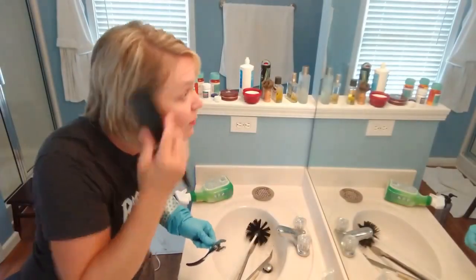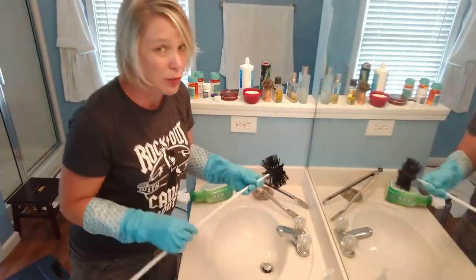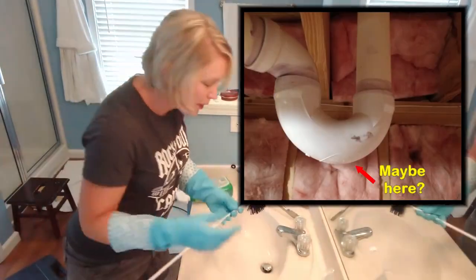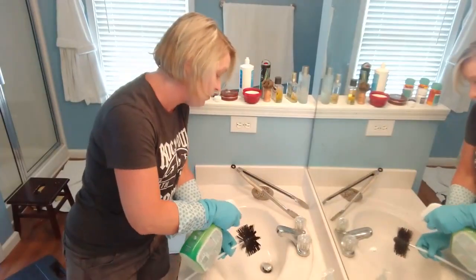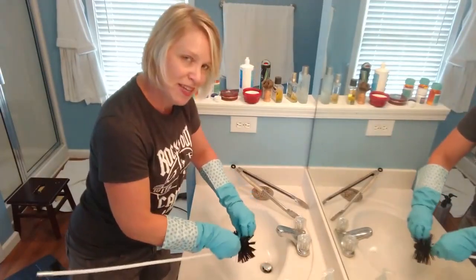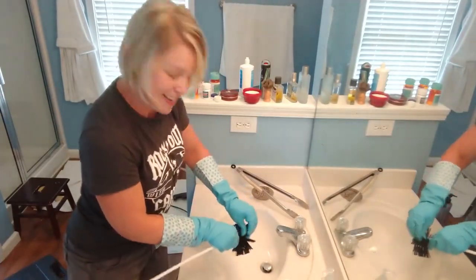I'm impressed after all of that. Now I think this thing worked fairly well. It is pliable, so it's meant to go around curves. I know it didn't go all the way through that trap, but I think it did get in there a little bit, and if it loosened some things up and got them rinsed out, that would be great. But I don't think that's where the main problem was anyway — I think it was at that very beginning part where everything was so clogged. And if that doesn't turn out to be the case, and all I did was just compact a bunch of stuff down in that trap, then I guess my next video will be about going to buy a drain snake.